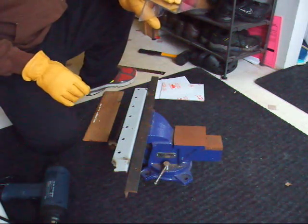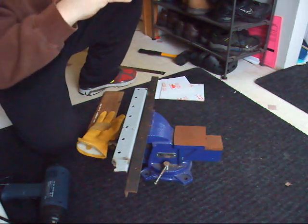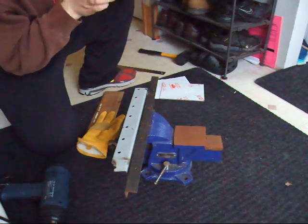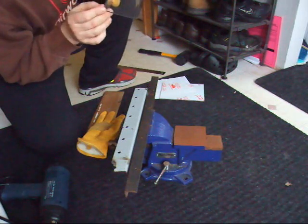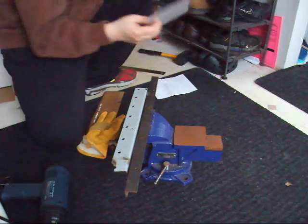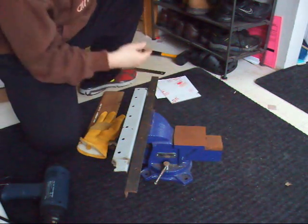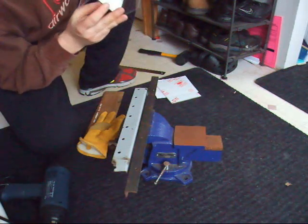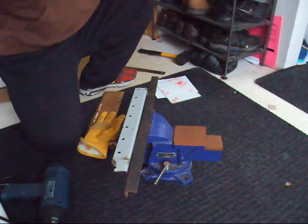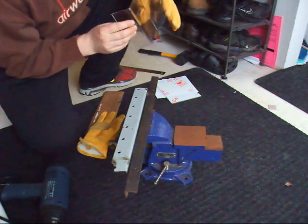So when I made my mark where I wanted my bend to be, I lifted my piece up a quarter inch and that's where everything should line up. There you go — one bent piece of Lexan. Now if you stay with the heat gun too long in one spot, the plastic will bubble up. I've got one spot here where it turned a little bubbly but it did milk out. My first bend was done with the plastic covering left on, and my second one I took the plastic covering off and it's much better. You can tell when the plastic starts to want to bend and you don't get it all caught up. It's way better if you take the coverings off.